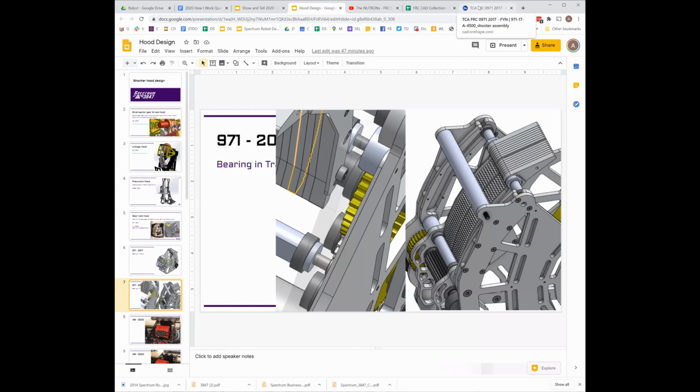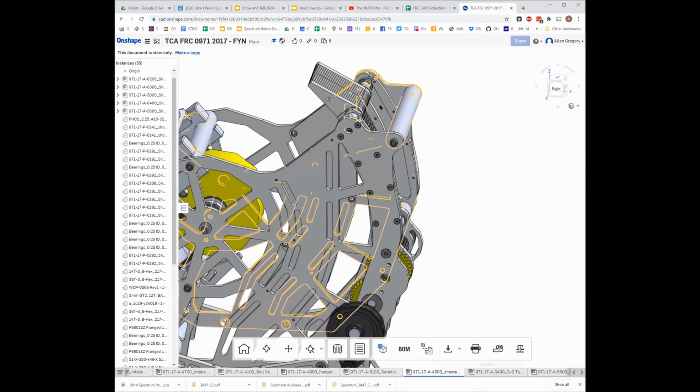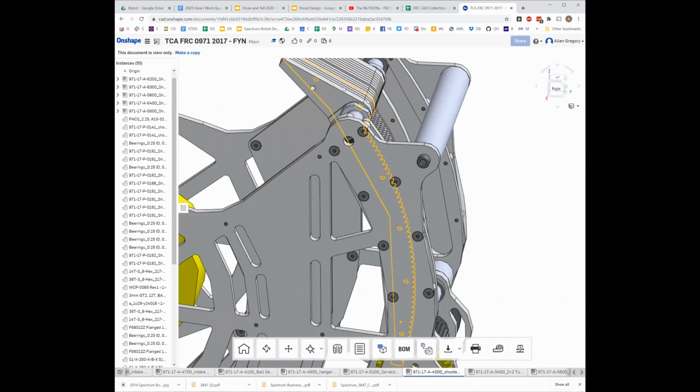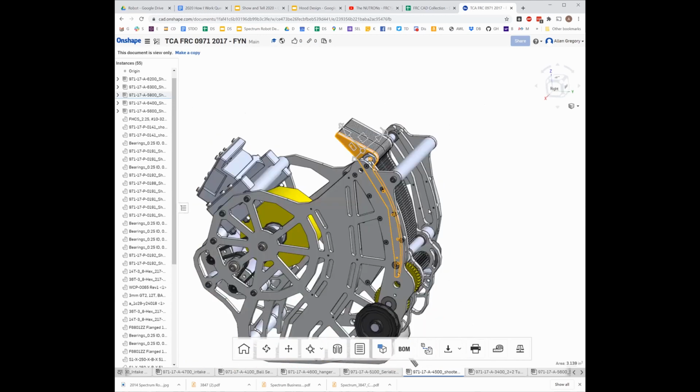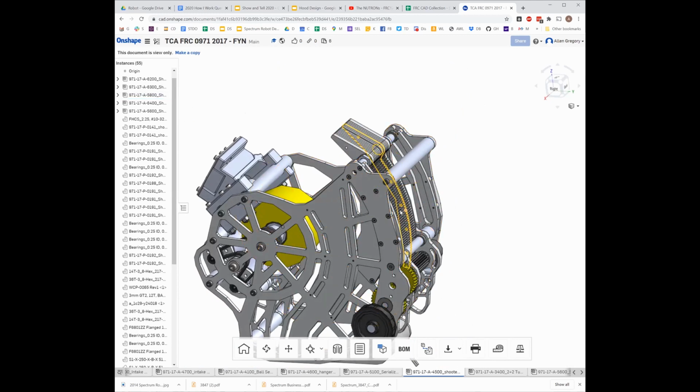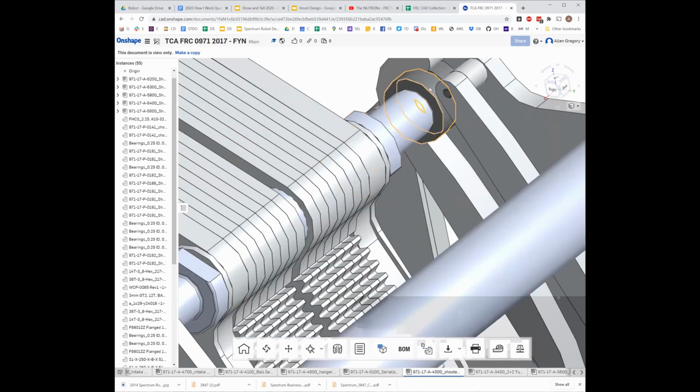So their whole rack system, to be really stable, that's one of the things: how do you actually move? How does this whole mechanism actually slide on everything? It's sort of like an arced elevator. It's having to move in this linear fashion, but along an arc. So the way that they did it was they have these bearings here for this top shaft. So there's two bearings, both the things I've clicked in orange.